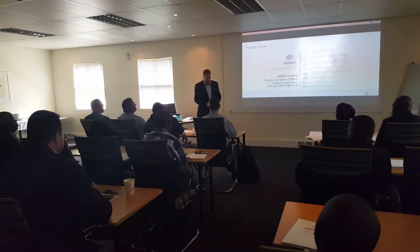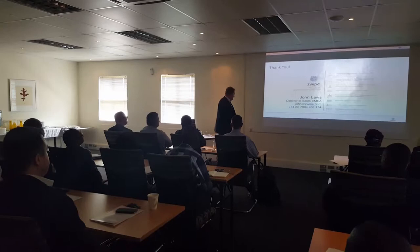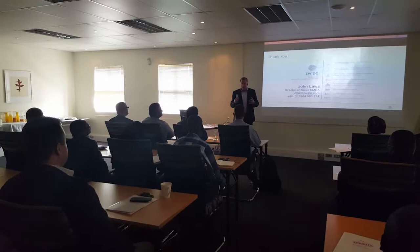The reader takes the power from the reader and all you're doing is the enrollment process — that's pretty normal. Now, going back to wall-mounted readers — using this card for wall-mounted readers, there are a couple out there that do work. One happens to be another French company called STID, S-T-I-D. They're really providing enough power for long enough to power this card. You're going up to the reader — this one hasn't quite got the same read range as the battery-powered one. You've got to be pretty close, almost touching it, to harvest enough power.